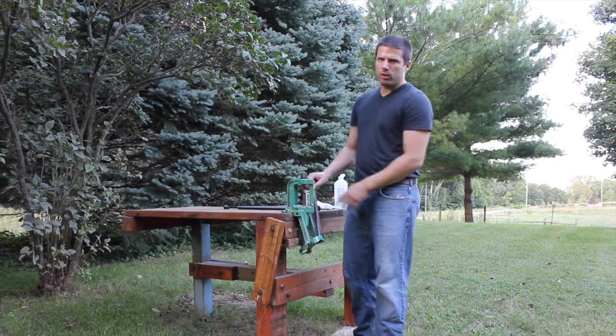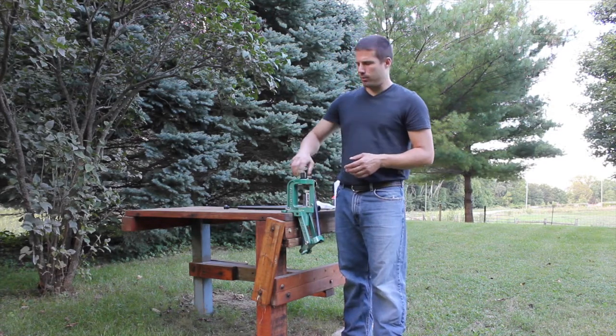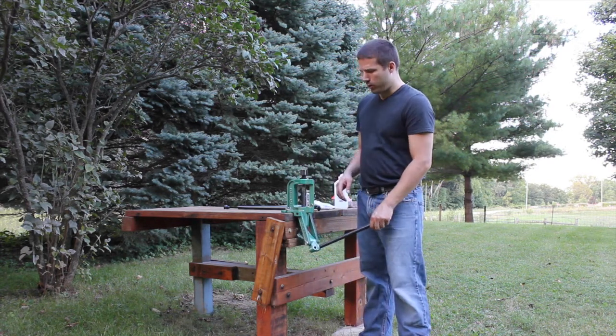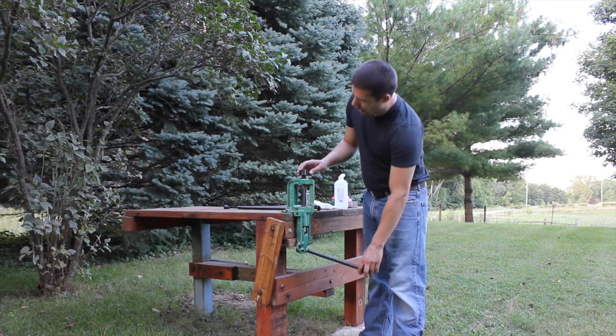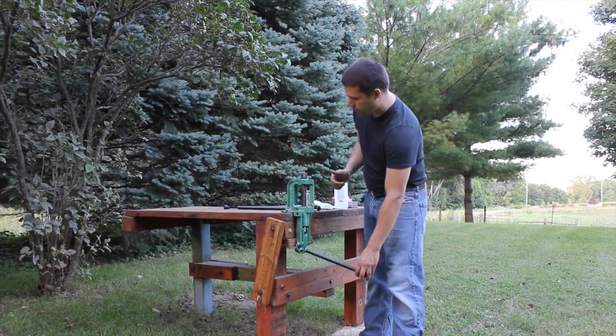If for some reason you encounter a bullet that's stuck in your die or really hard to push through, you can screw the die out part of the way. That gets your ram up into more of the power stroke, more leverage, and you can get that bullet part way through the die. Then just work the die down in and get that stubborn bullet through.